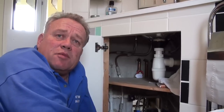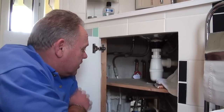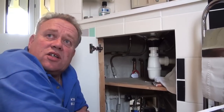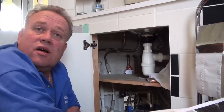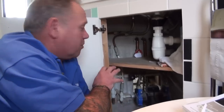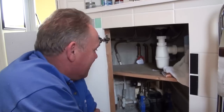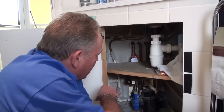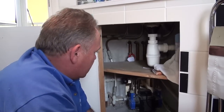The cold water tank should be a minimum of a hundred gallons to feed a power shower like this. These showers use an awful lot of water and it isn't long before the tank can be drained. Using a twin impeller pump, the tank can be drained more quickly than it's allowed to refill.